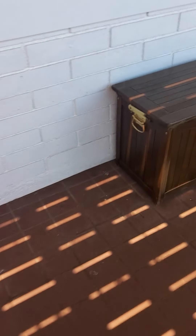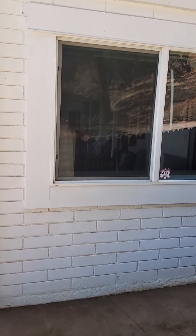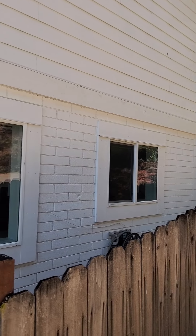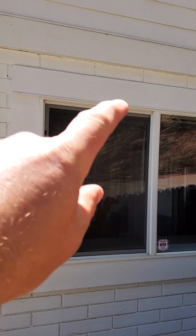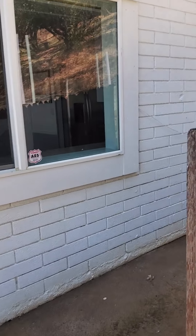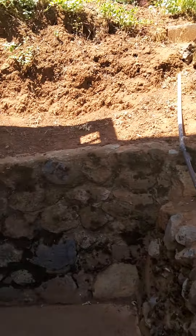I usually see that window flashing under gable openings where there isn't a lot of overhang coverage. I took about 15 photos of the driveway as well. Where they do flashing above the windows it's because there's not a lot of overhang to protect against water intrusion. You technically have two points of flashing — one above the ledger or skirt board tied to the rim of the house, and another flash point above that. We'll keep going and probably do the dock first, then walk around front. You could probably re-insulate that PVC line.